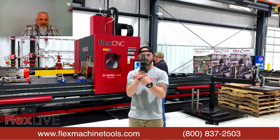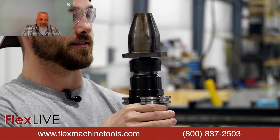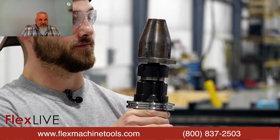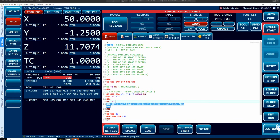And Isaac, I'm going to have you pull up the screen here so everybody can see the program. And I wanted to touch base on this too. So we have a built-in canned cycle for our flow drilling applications. This G77 line that you're seeing right here is our Flowdrill canned cycle. And how it works is the cycle is broken up into different depths that are run at different feed rates.